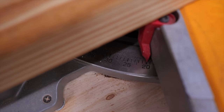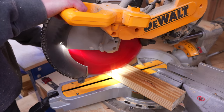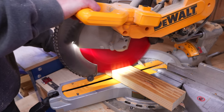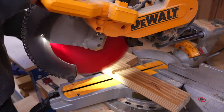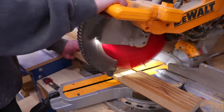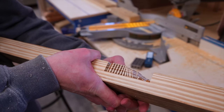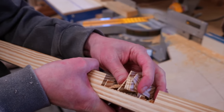Angle your saw to 20 degrees. Note the block in the back — what this is doing is pushing your workpiece away from the fence enough that you'll get a nice straight cut. If you do not do this, the back of your notch will actually be a bit higher than the front. Now I'm starting at my second mark and working my way down to the first one.